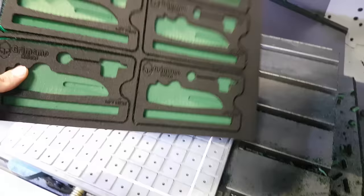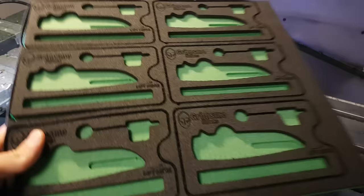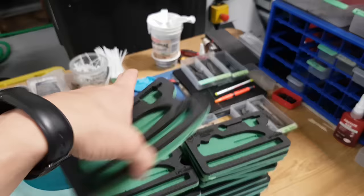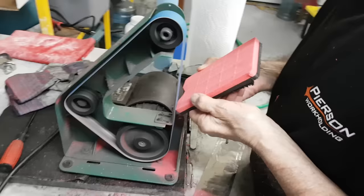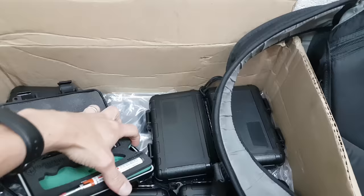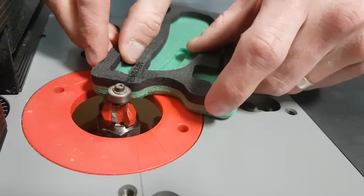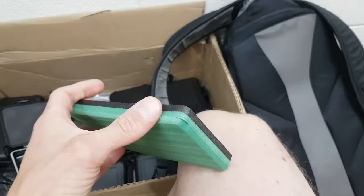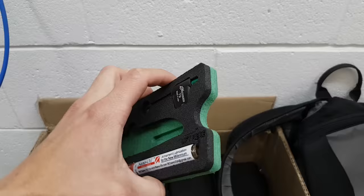It actually suctions the grid pattern into the bottom but after about 20 minutes it pops back up — no big deal. When you break it out it's got a burr right here — that's not cool and it also doesn't fit into the case that way. We used to have Barry do the sanding on the sandpaper, but then I had a genius idea: he is a woodworker by trade, so he used his router table with a corner-rounding bit to round the bottom. He says it's tricky to get perfect every time, but we'll get better and better. He played around with the fence and the way he holds it, and it's getting a very fantastic corner round on the bottom.